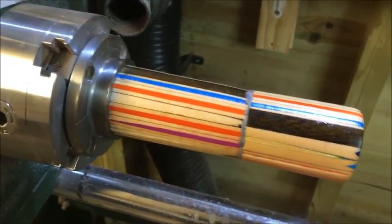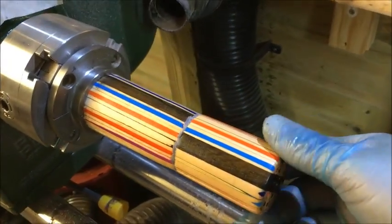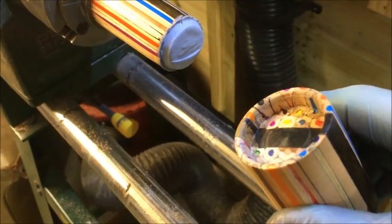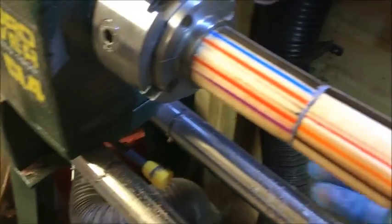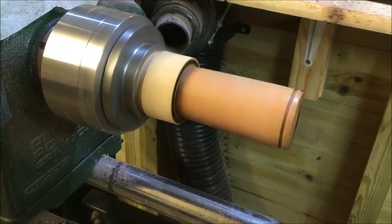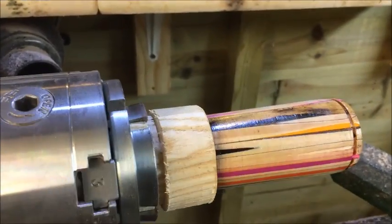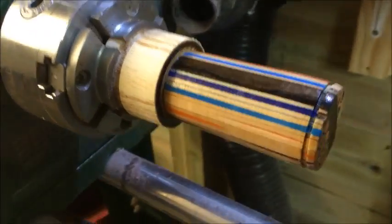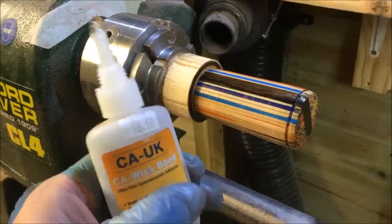It's starting to take some shape now, looking pretty good. I started rubbing it down slightly but with these pencil projects you can't really sand them heavily. Don't get a load of sandpaper and expect a really nice finish, because what happens is the pencil material comes off onto the sandpaper and goes all over the wood and it looks horrendous. Do fairly light sanding — I found it best using some really coarse paper just lightly, and then very lightly with some fine paper.